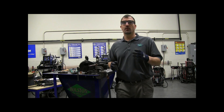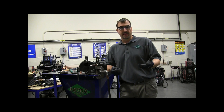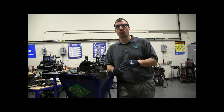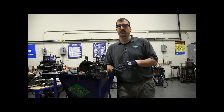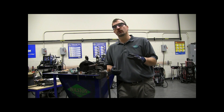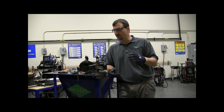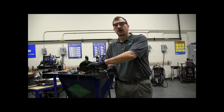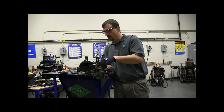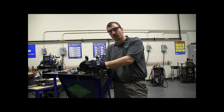If you're always welding on very small parts and it's not feasible to hook a work clamp directly to the part, that's perfectly okay — there are a couple of options. I also want to talk about maintenance with the welding cables and leads around the work clamp, because this is typically where we see problems. For a semi-mobile workstation, I still really like the C-clamp style because you can quickly detach and reattach it without any tools.